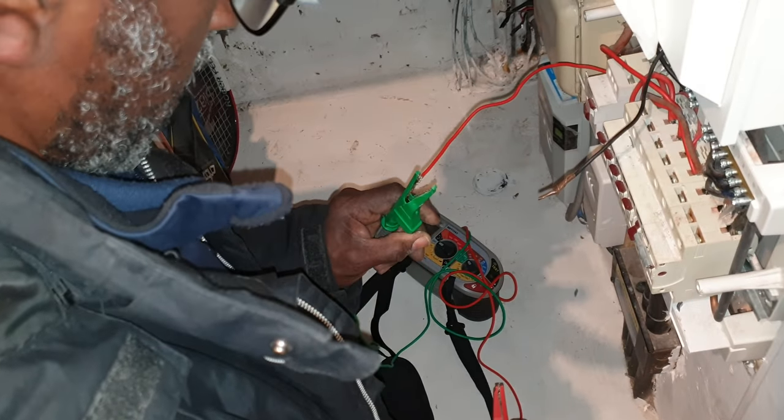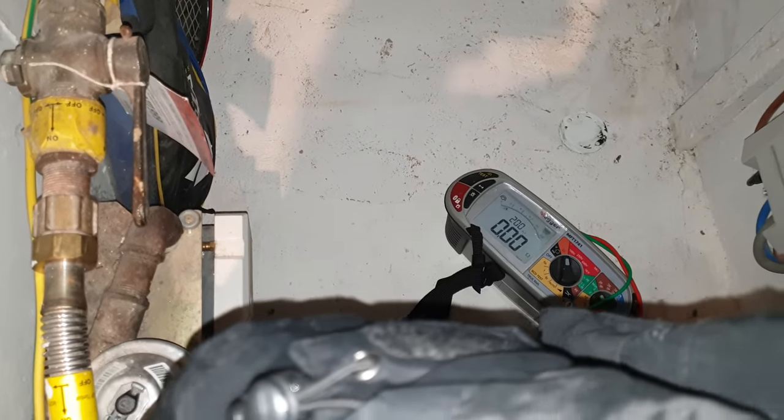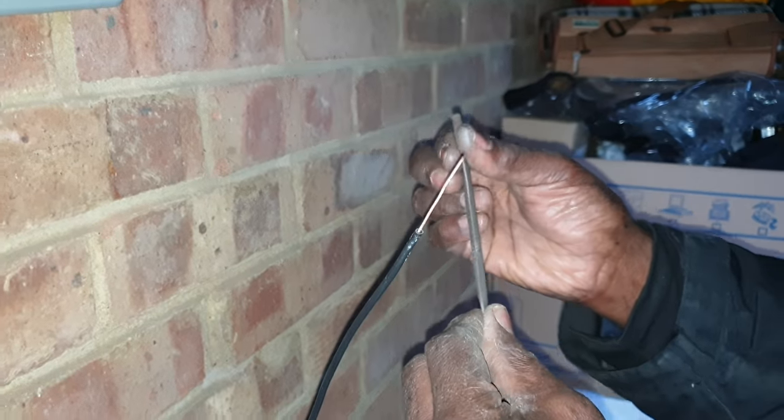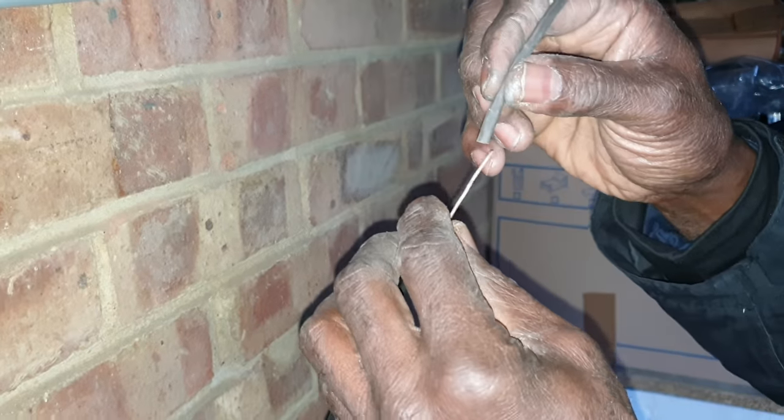So I've got one cable on the body of the pyro, the MICC. So I'm going to put this on continuity and see what I get. Okay, leave it there. So that's zero. So I don't think it was that one actually, else it didn't move. So it's probably this one. Yep, straight away. So 0.79. So that's the one up there is a neutral. The other one's the phase, right? So the one that I put down to earth down the bottom was the neutral.